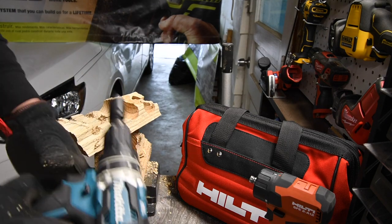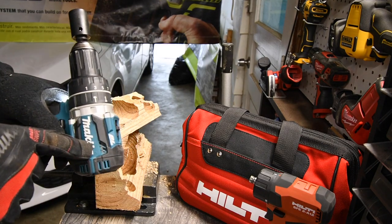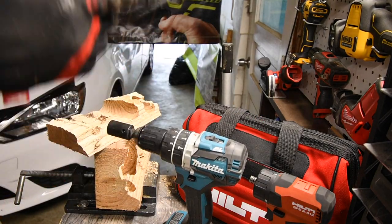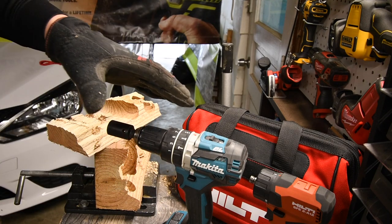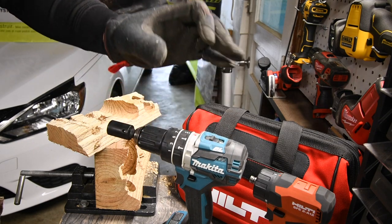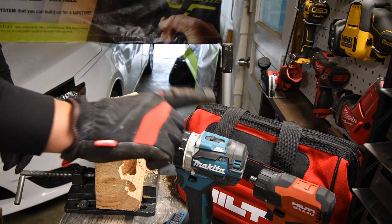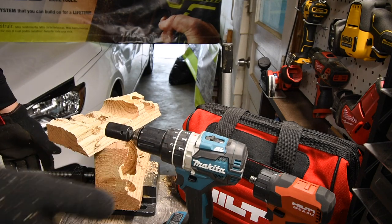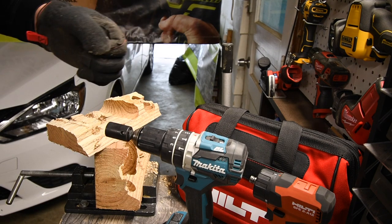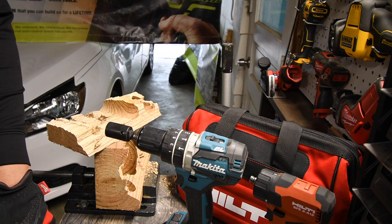It's a small motor, but it has so much power. I just want to show you guys that you could actually simply take apart your tools, clean them, and keep that motor clean. Your tool — I guarantee you — would last longer, because the less debris on your tool, the less heat that will build up and the longer the tool lasts. I highly recommend you guys take apart your tools once in a blue moon and just get the debris out of there. If you found this video helpful, please like, hit the bell button, and subscribe. This is Dave Nicholas — thank you for tuning in.